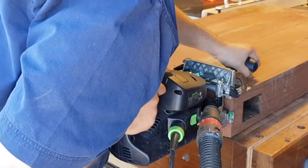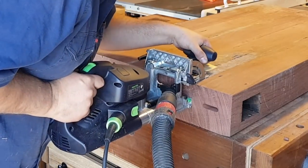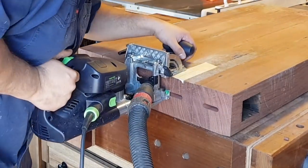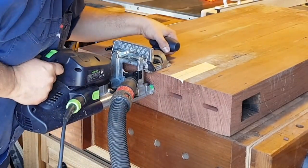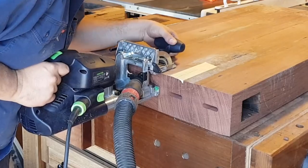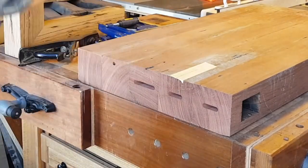What I'm doing here is using the Domino XL to cut longitudinal slots. I've got four 45mm slots on either side of center, and a 90mm slot on center. If you're very careful and use the scale on the perspex screen either side of your line, using the right measurement each time, you'll get a very accurate and nicely cut slot. It's easier and faster than doing it with a router, especially when you're plunging 75mm deep.